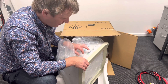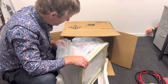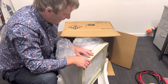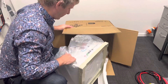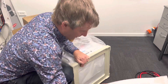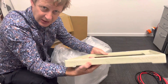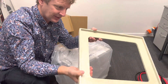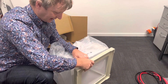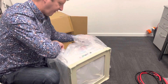I've already livened up the BMS prior to this, so that's why the lights are on — the lights won't be on when you get it. The BMS will actually shut itself down; I think it's in about a day if you turn the breaker off, the BMS will just self-power down so it doesn't drain itself completely flat. Each battery module comes with its own nice solid base, so you can stack it — it just sits on the floor, then the next base is designed to fit around the top edge of the next battery.